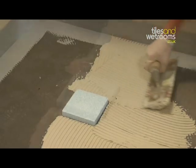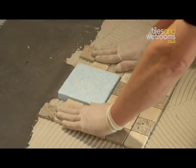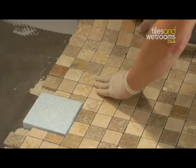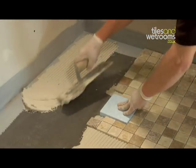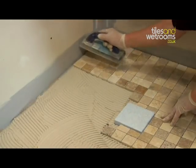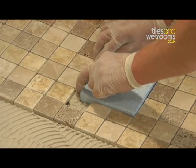The beauty about these tileable shower trays are that they can be tiled in many different types and sizes of tile. It is, however, very important that you note the following facts. We would recommend a tile that offers a good slip resistance, as a high polished tile combined with soapy water can sometimes be very slippy. Regarding the size of the tiles, any size tile can be used.